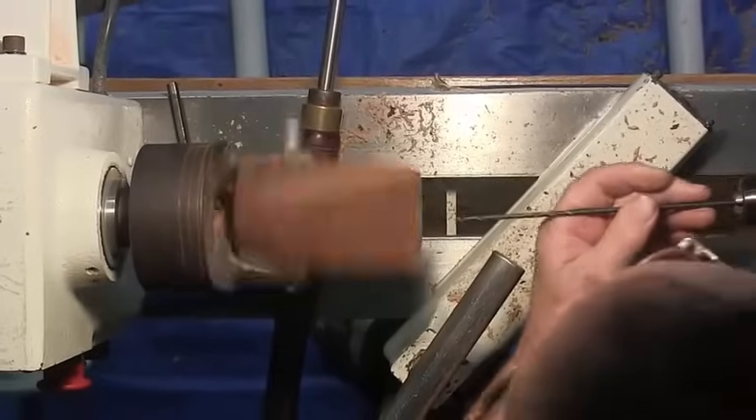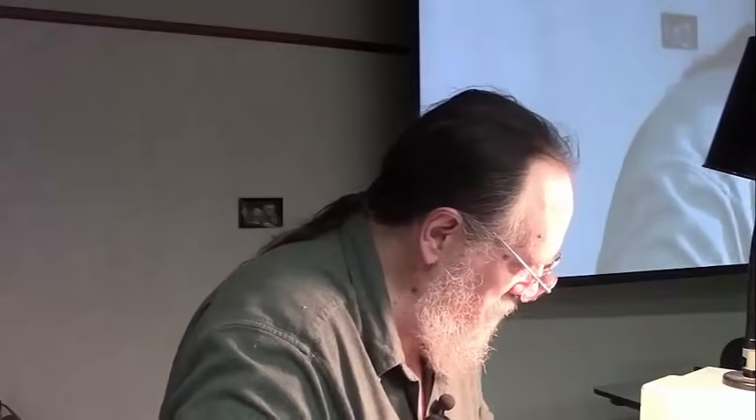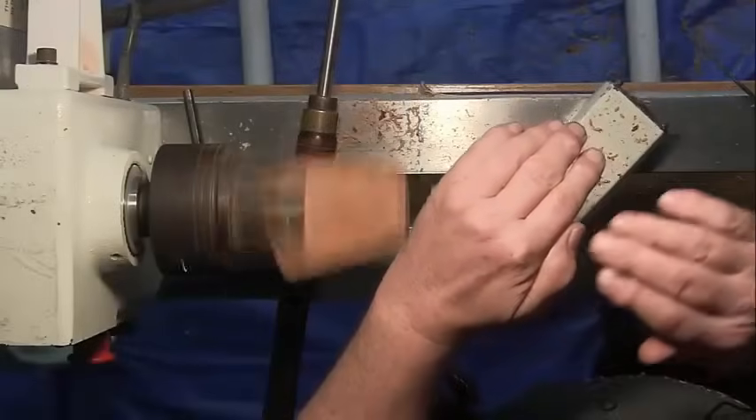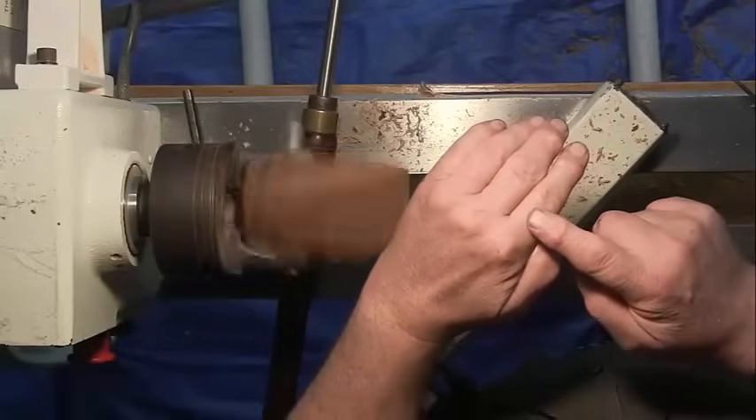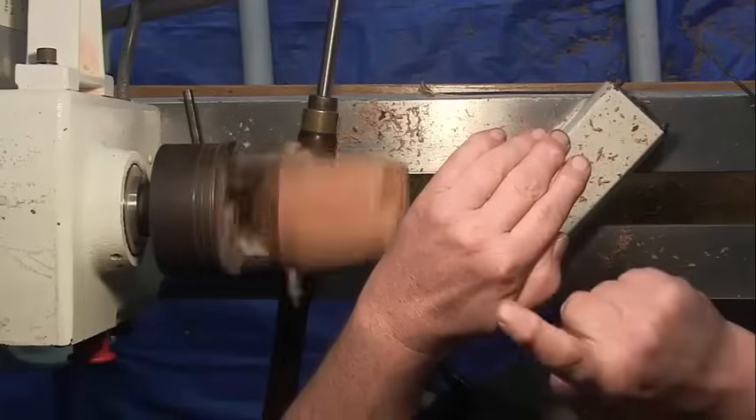So it's inadvisable to break the laws. There's a fifth law I've been thinking about but haven't quite figured out the best way to say it. Cutting what don't need cutting will not get cut — what needs cutting. One of the things I see frequently in students: if you've got a bowl with a hump in it and they're trying to get that hump out, they'll start here and work a little ways, say that ain't right, then go back to the start and do it again — and all the time they're doing that, they're making that hump bigger. It only helps to cut what needs cutting.